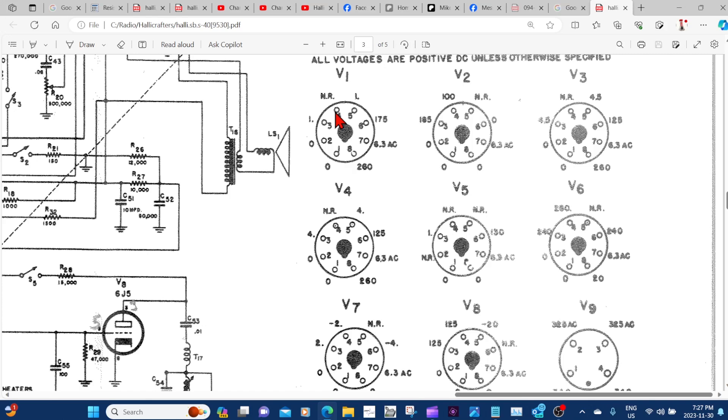Those pin numbers — one, two, three, four — are directly equated to numbers on the schematic. So if you're looking for a resistor on pin three, find the notch, count off three pins, look for the resistor. It's just that simple. Also, some newer folks haven't learned all the resistor color codes — I'll put a link to a resistor color code calculator in the description for this video.